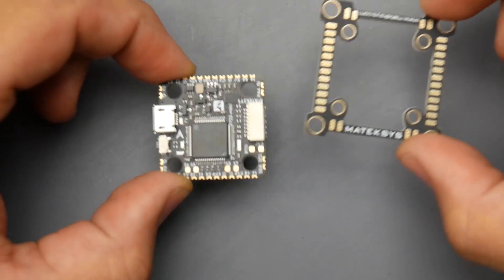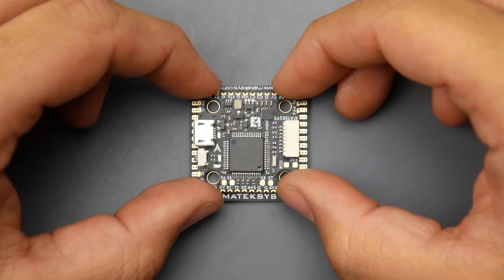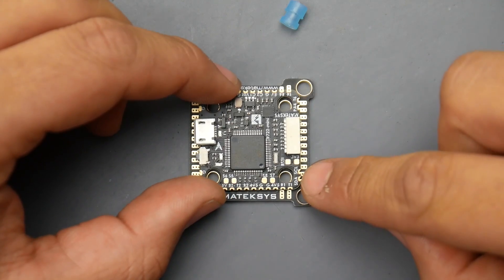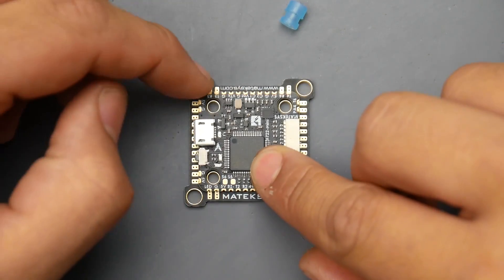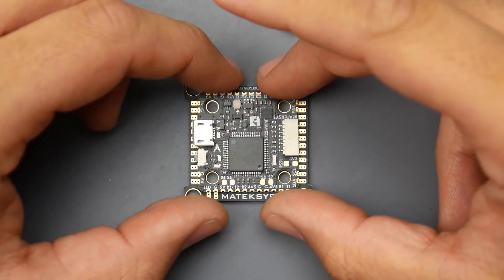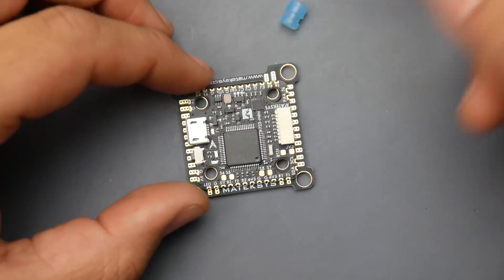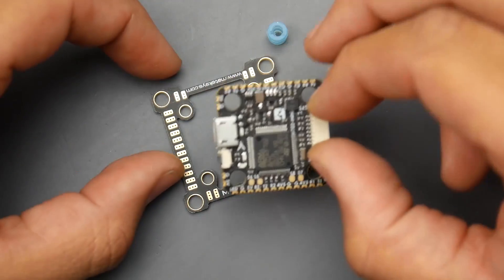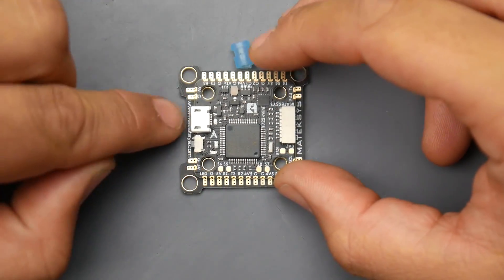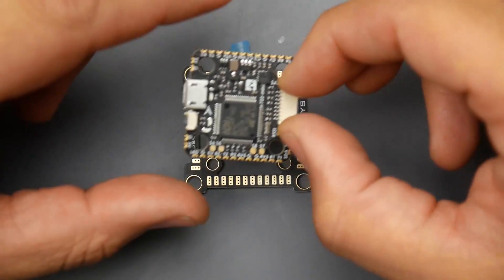Before continuing, if you want to use the 30 by 30 mounting hole, once you set it up with the correct grommets and screws aligned perfectly, you can solder it to this board — just one point here and one point there to hold it in place, then solder straight to the pads. You've just turned it into a 30 by 30 stack with a little bit bigger pads for soldering. There's nothing in the way of the USB and nothing blocking this side either — it's an unbelievably thought-out piece of hardware.